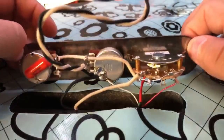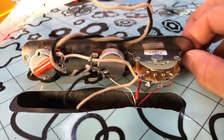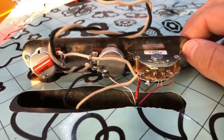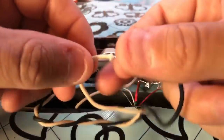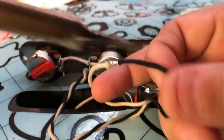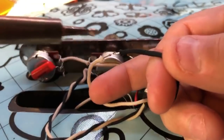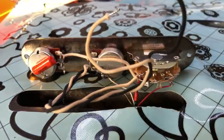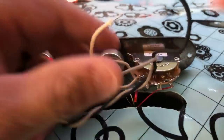Once the heat is transferred from one component to the other, the solder will stick and it'll be a good joint. But if you move it before the larger component cools below the melting point, you could have a bad solder joint. Make sure you do not move it. Most people wouldn't hold it in their hand like that because it heats up the tips of your thumbs so badly.